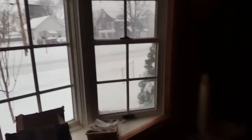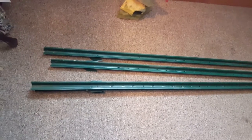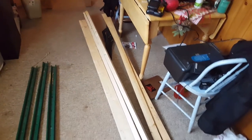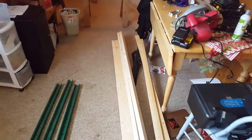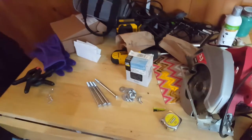So what I did with my snow day is I grabbed some lumber and then I had these rails, which I used to put the dolly into, and I'm going to improve them with 2x4s rather than these cheap little furring strips that I had, as well as make notches at the end of the 2x4s so they can fit together. Then I'm going to use these bolts and wing nuts to tie them together so I can get 12 feet of track instead of just six.